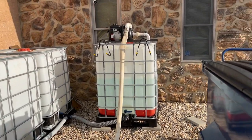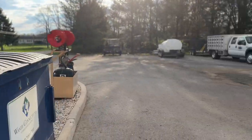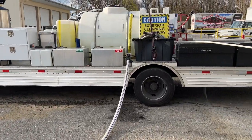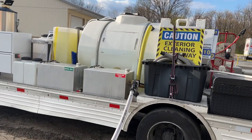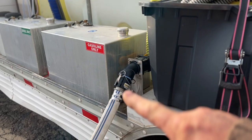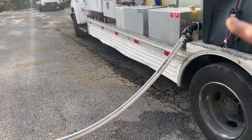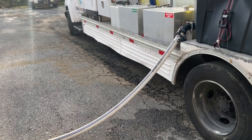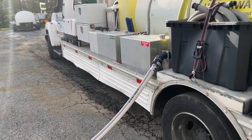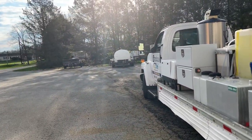We basically have our big pump here and it connects to the truck. That's why we always put fittings at 45 degrees — on our water trailer or truck — so that the hose when you hook up lays down nice and relaxed. You never want to come straight out with the hose connections, whether it's on the truck or on the big water trailer.